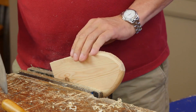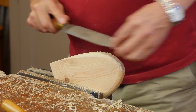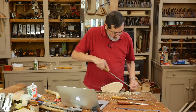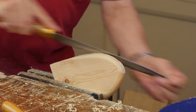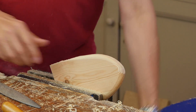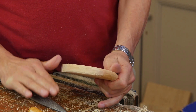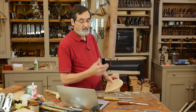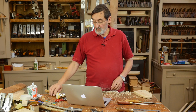We do it the same way with the rasp, but it's coarser. The spokeshave works better, I think. We go in and take off the hard corner again, work it around, and we still have flats on there — but that's another way of working this wood. The spokeshave is much easier on your body and works more quickly than the rasp. You can use fine rasps and then sandpaper after to refine it, and then you've got your round over done. It's wonderful for working with children and great for learning grain orientation.